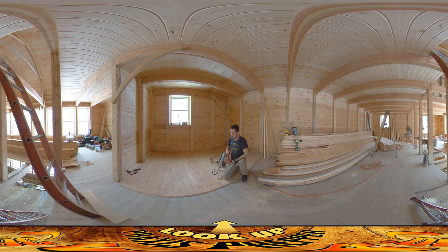I'm going to use this saw to do the cut, but before I do I want to make sure I set the depth of the blade correctly so I'm not cutting down into the actual floorboards — that's not an easy thing to undo. You'll notice I've got the saw unplugged for this; that's a safer way to do it. You don't want to accidentally hit the trigger. I'm going to loosen the locking mechanism, which frees up the little platform that sets the depth of the blade. I've got a piece of this plywood and I'm going to set the blade so that it will just barely not make it through.